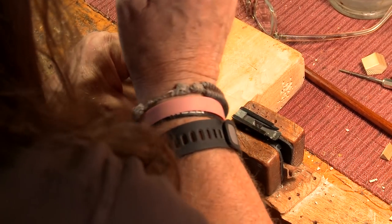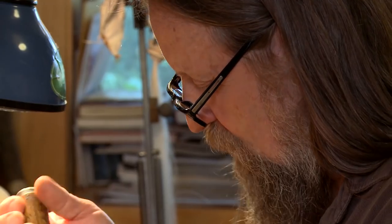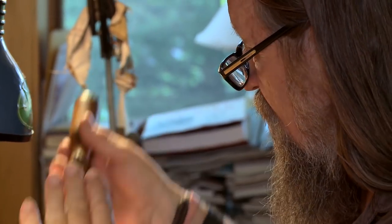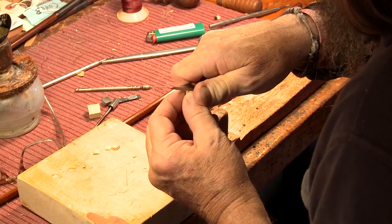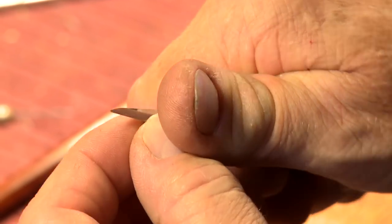So I can chop myself some piece of blank wood and start roughing this in. What I'm trying to do is match the shape — the angles — the angle of the pockets slants in on both sides and slants on both ends. So I'm going to try to reproduce that same shape. And they're all different; every bow is different. Now I take the underside of this plug and I carve out a little bit of wood on both sides, and this is going to make a space for the knot to go into. Then I take a file and smooth this out.